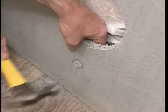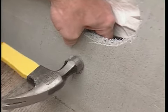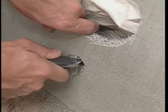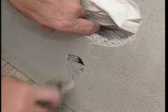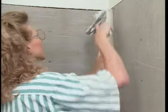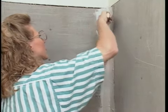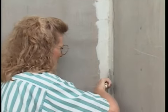Since openings for the spouts, valves, and handles will be covered by the tile itself and by some sort of plumbing trim piece, it's okay for the holes in the backer board to be pretty rough. Sometimes you can just create small holes with a hammer. Mudding and taping the joints is done the same way as it is for the floor, although working along the inside corner requires a little more skill with a taping knife.